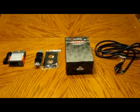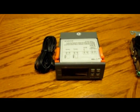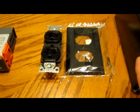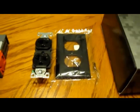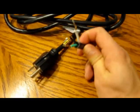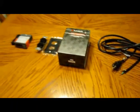These are the different elements you're going to need in building this digital temperature controller. First, you're going to need the actual controller itself. This is the STC-1000 — I got it from China off eBay, I think it was $23 to $24 for shipping. The cord beside it is the temperature probe itself. I got a black receptacle with a black cover plate from Lowe's, that ran about $4 or $5 total. This is a Radio Shack project box, 7 by 5 by 3 inches. And then I've got the grounded plug with three wires: the neutral, the hot, and the ground.